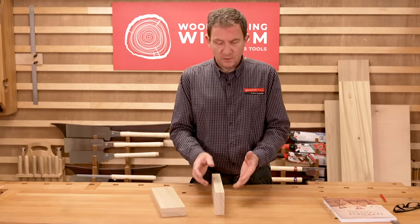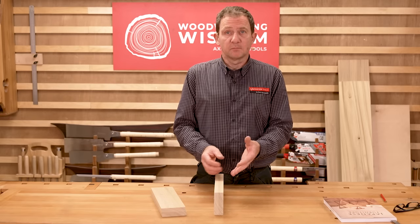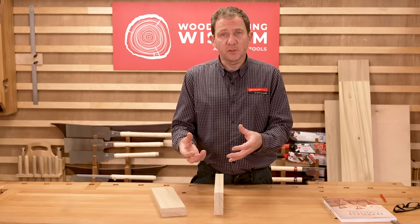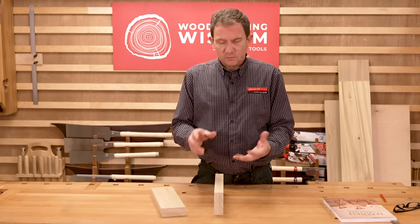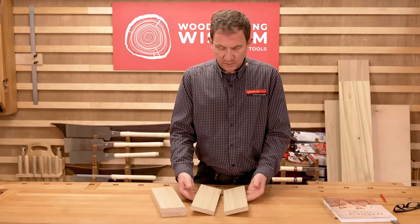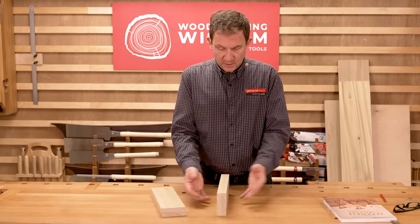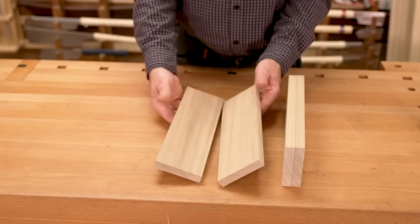So therefore, if I laminate it together, it'll make the legs stronger because they're glued up. The grain direction will cross over a bit so they won't be as weak. It means I don't have to go and buy something else just for that little stage. So that's quite an important part. Could be quite nice. So I've already machined it, just had a quick look at what we've got. Try to line up the grain so the colour matches. So that'll do two. This will do the other two.